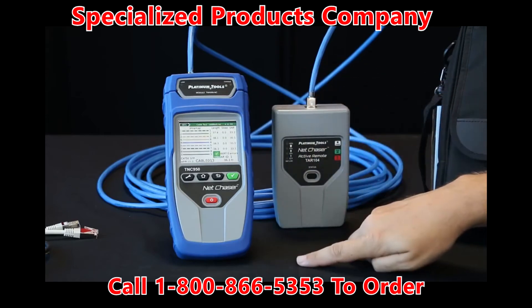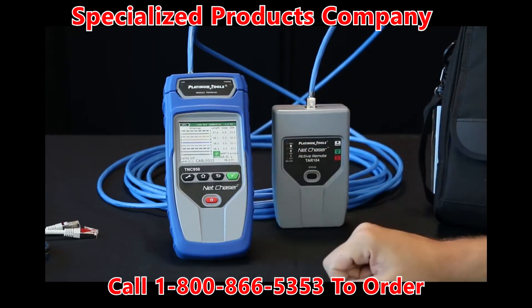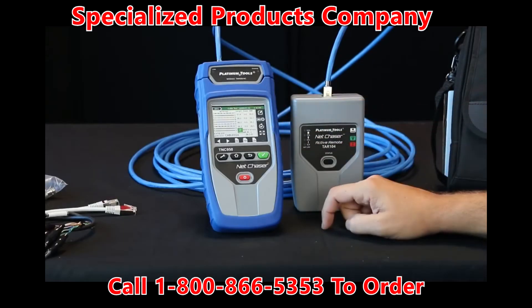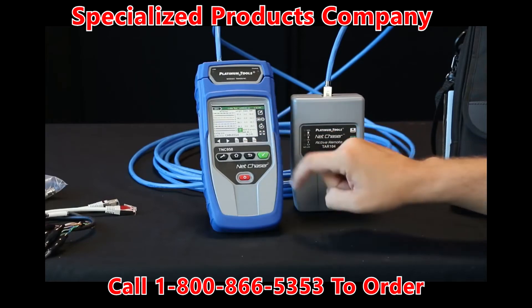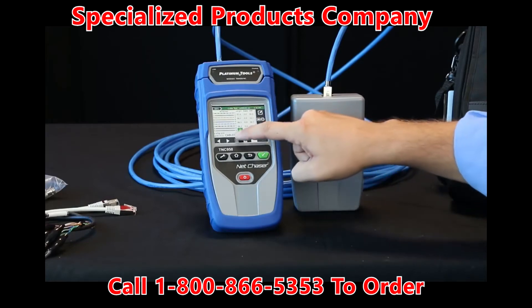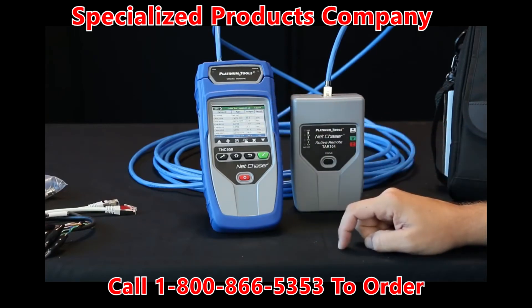You have your numbered ID and total length of cable. You can expand the view of the screen here, and you see your cable and pico farads for length measurement. When you want to save test results you can select either the PDF or CSV format. If you want to see a list of all the cables you've run, just go to the list there and you can see them all.